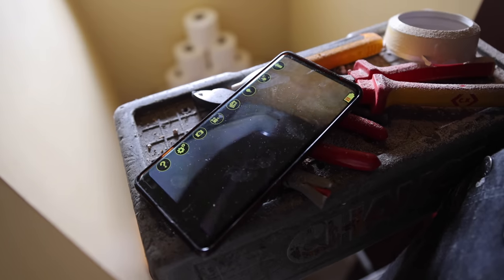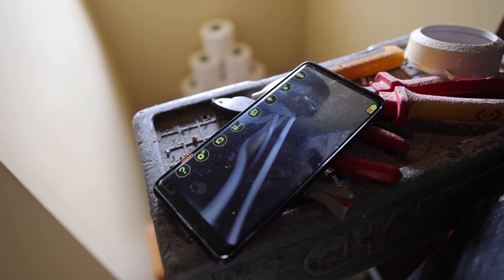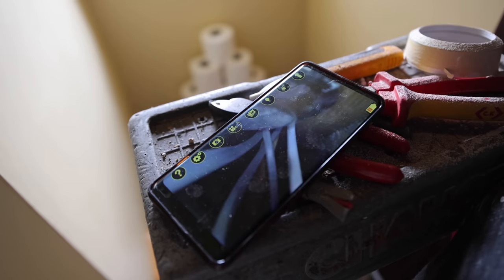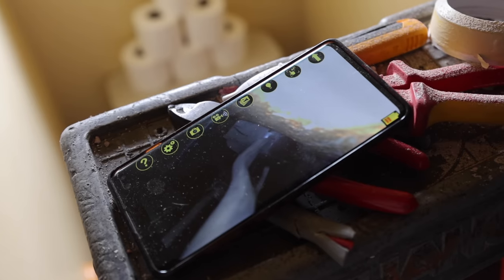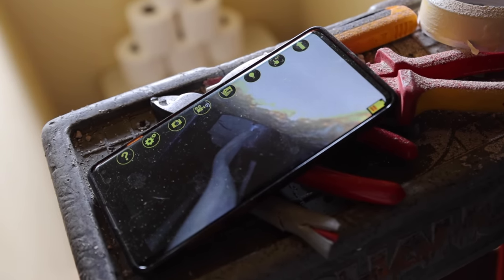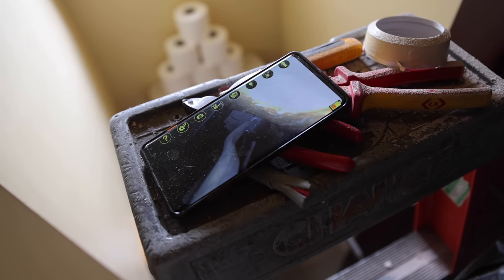Look, that looks like the 6 mil going into a JB, which would, maybe that's the poor joint, let's try and get to the other side of it. I can see some basic insulation. I'm pretty sure that is. So that might be where our break in the earth is. Wiggle that, you can just see that JB moving. So that's what our 6mm is going into. And surely that's got to be where the break is. So now we're going to have to try and find that JB or just pull really hard and see if it comes to us.